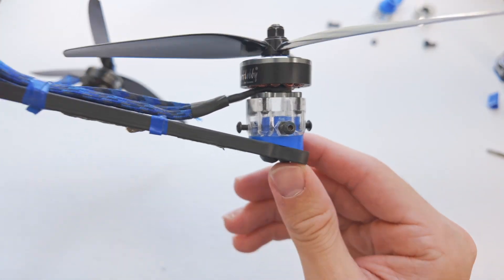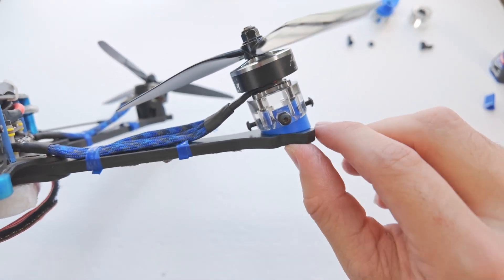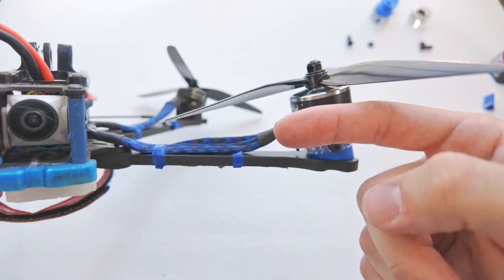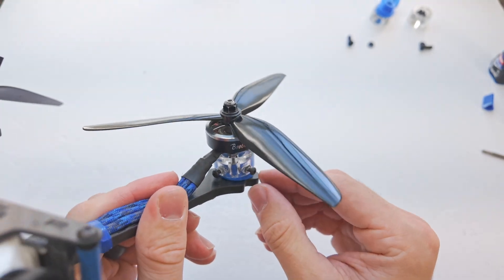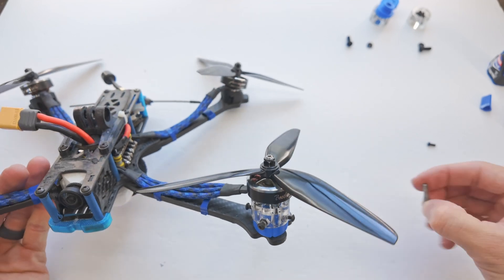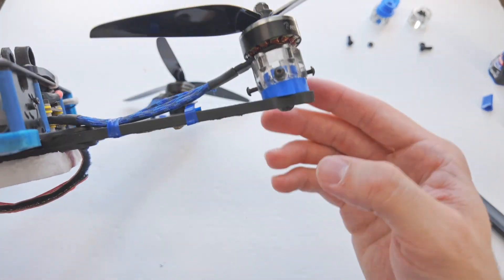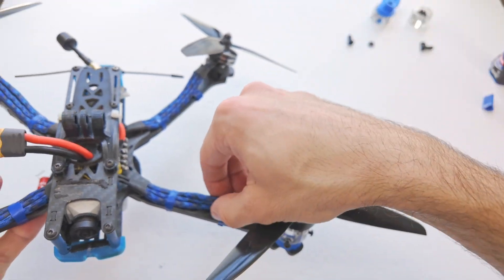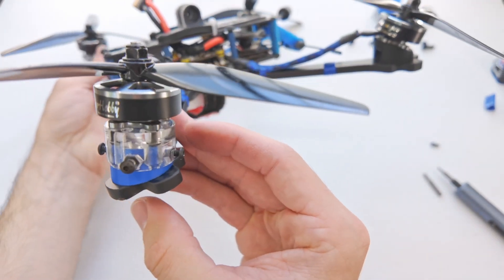Now we have it all connected — it looks awesome. This is a seven inch size quad, by the way, with seven inch props on here. With this angle of the mount — I think it's 15 degrees — it makes it so it's not so extreme that the props are going to cut back into the arm. That's how you assemble it. You can get that at rcwithadam.com or even get them printed from PCBWay, sponsor for this video. It's kind of a pain because you have to change bit sizes, but it's relatively easy to change the angle mount compared to the old way, which was changing four screws on the bottom and four screws attaching to the motor, because you can't twist the motor — you have to be able to change the angle without changing where the motor wires are coming from.